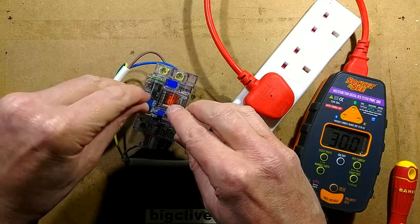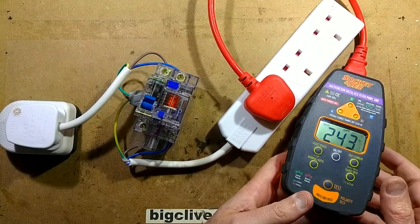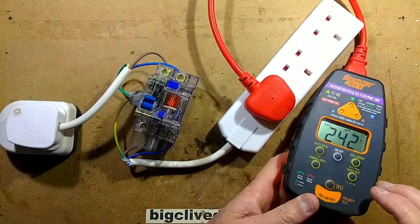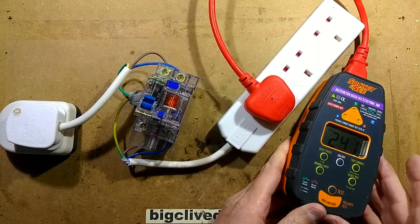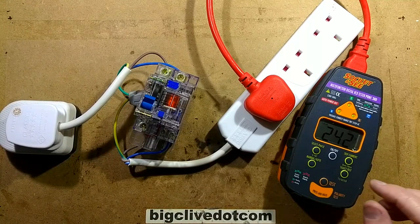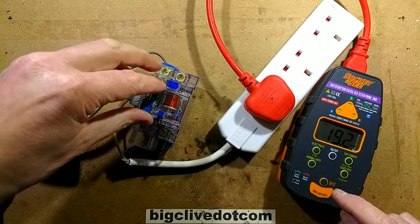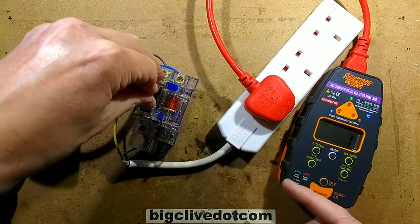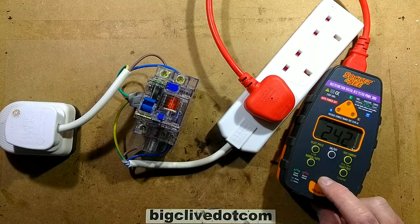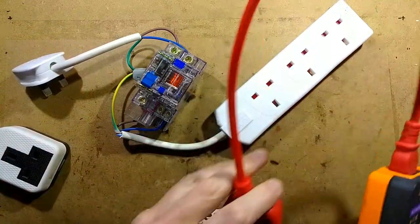Further testing gives 30 milliseconds, which is getting on a bit for this test. I'm not sure — is it 20 milliseconds that's the recommended figure? Ultimately, as long as it trips. It's consistently getting much lower on one half wave — about 19 milliseconds consistently — just like the other one. So we've ascertained it trips in both half waves. Let's take it to bits now.